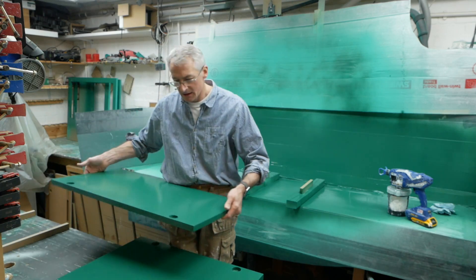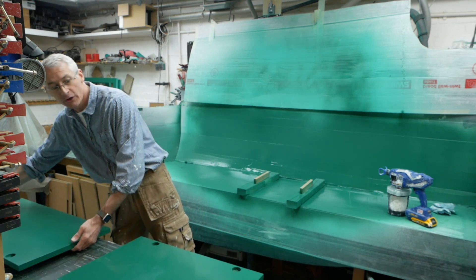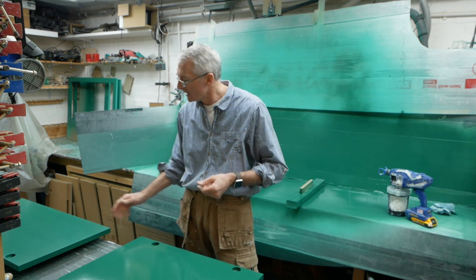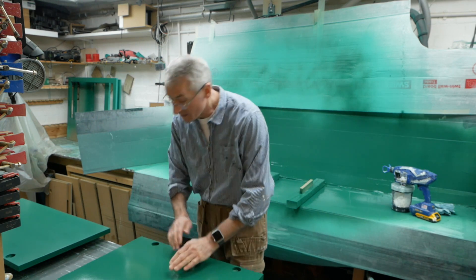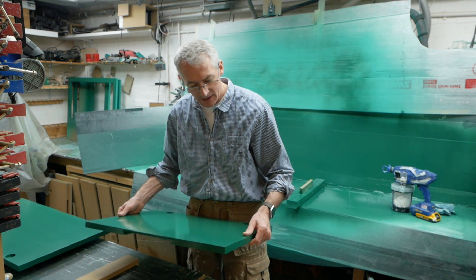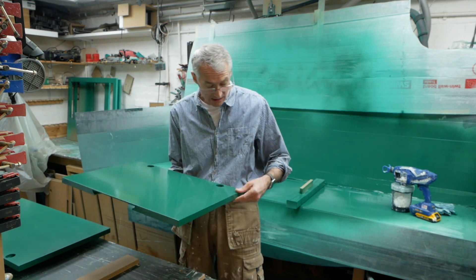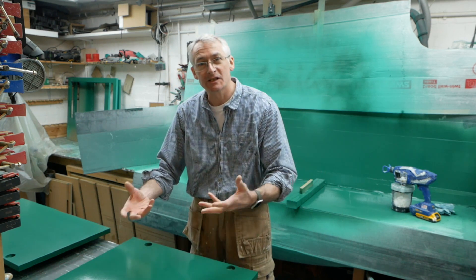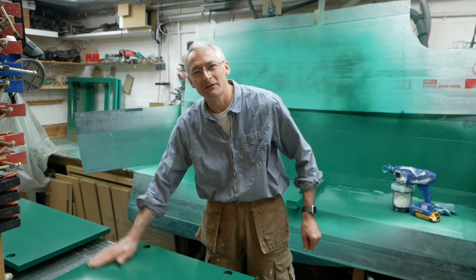What I've done is matted one of the other doors right back with P500, then P1000, then P2000 Abralon — that thin foam-backed Abranet. I'm going to give it another coat with the little Graco Ultramax airless sprayer and see how that looks in the morning. The downside of Benjamin Moore paint is the 16-hour re-coat time, and it takes a while to really firm up. This was done on Thursday night, so it's only been three or four days. It's good and solid, not fingerprinting or marking, but it is quite a long drying time. We'll give it another coat and see how that goes.